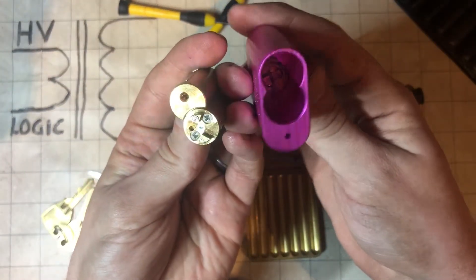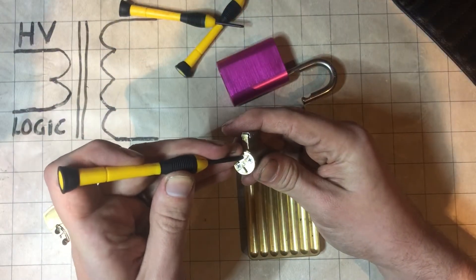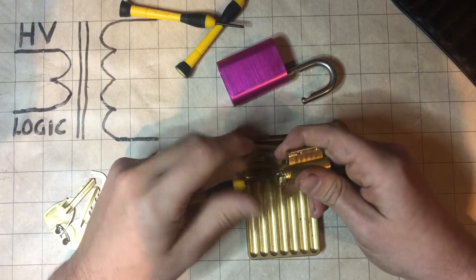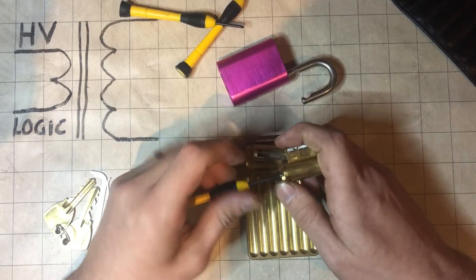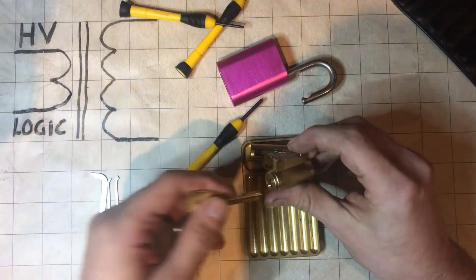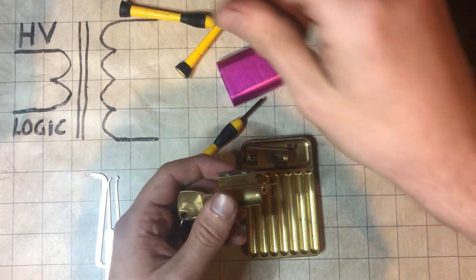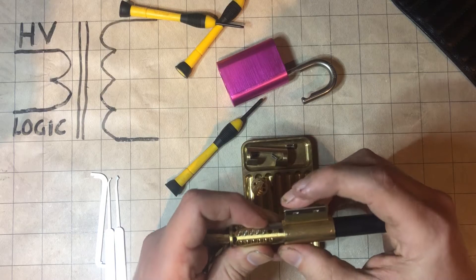What's inside — beautiful body on these. We've got this standard sort of Lockwood housing here, a couple of screws on the back. Take this pin out and make it a key-retaining lock. Let's get that locked up. These are in tight too, also probably got some blue Loctite on them. This must be much easier to gut and reassemble now that those are broken loose. Stick our key in and get a shim — don't really need to shim it probably, but shims are cheap, you can use them more than once, and it's never a bad idea to shim.